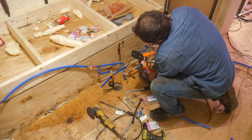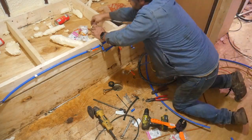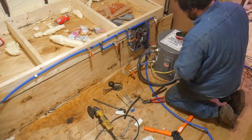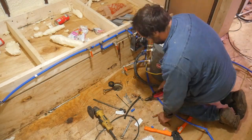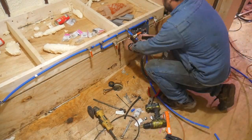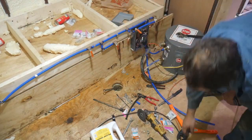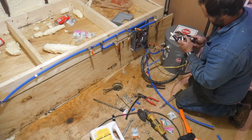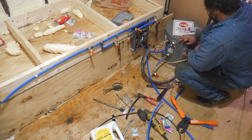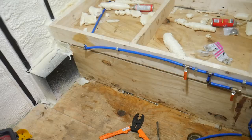I don't think I hit the record button on my camera so I didn't end up with video. But what I've just done is hooked up these three valves you can see here and ran this blue line toward the left — it turns just off camera and goes under the bed to the city water connection in the black door installed at the start of this video. This area where I'm squatting will actually be under the bed and is where the fresh water tank will be. I'm also hooking up the instant electric hot water heater and plumbing it into the tank hot water heater. I've brought the water hose through the door to pressure-test for leaks.